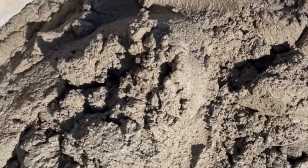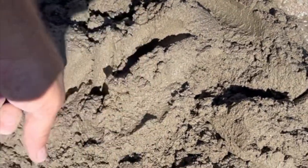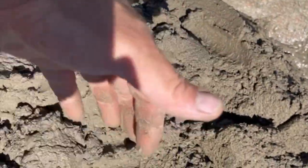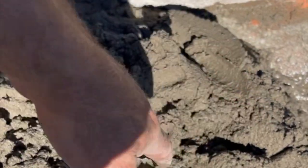There you are — there's the mix. Normally in the winter you see me using a real dry mix, but as long as it's got some moisture in there. Look at that — this looks wet but it's just got the plasticizer in there in the right amounts. It's nice and sticky but there's not loads and loads of water in there; it's just allowing the plasticizer to work.